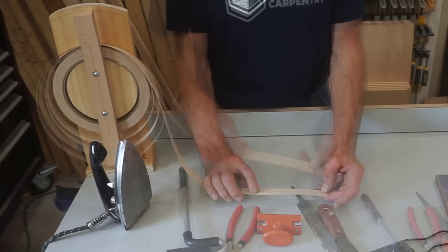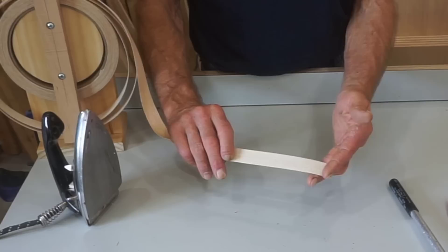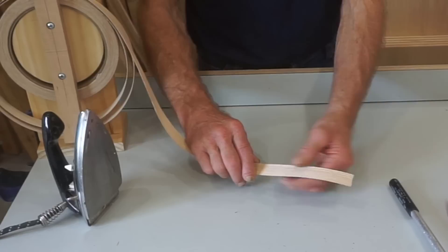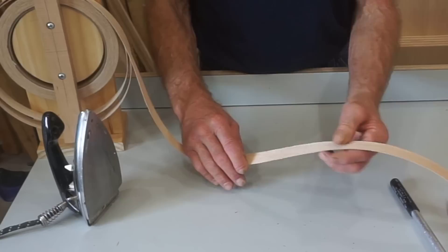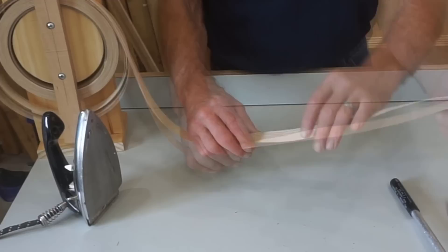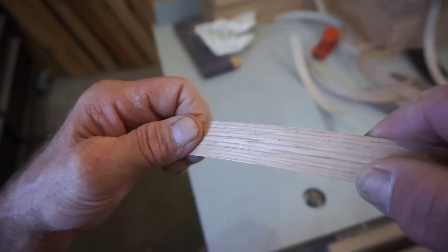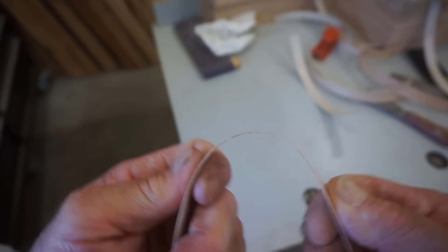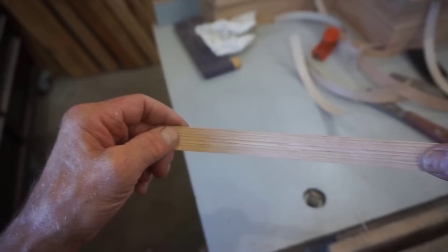This red oak edge banding is a vertical grain, not a rotary cut, so it's got a fine grain structure on the back. It has a thick layer of hot melt adhesive on the back that's heated up with an iron and sticks like crazy. You might wonder where they get a tree tall enough to make a 250 foot strip of edge banding in one continuous piece. Well, the secret is that they don't — this stuff is very cleverly finger jointed. There's a joint right here between my fingers. On vertical grain wood with that finger joining, it's virtually invisible. And if I bend it, there's no way it's going to crack because of the joint. They probably use a flitch of four or five, six feet long, finger jointed together to give a continuous strip 250 feet long.